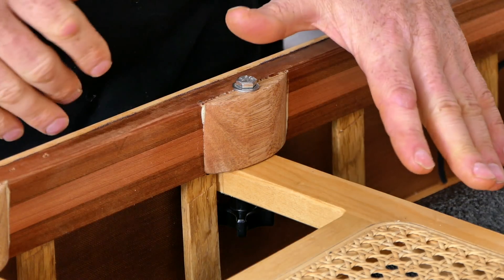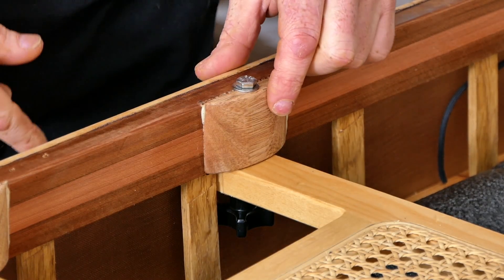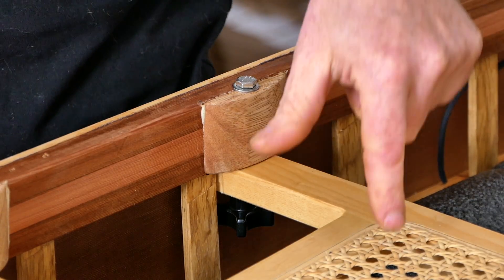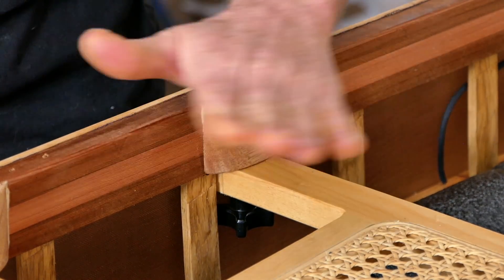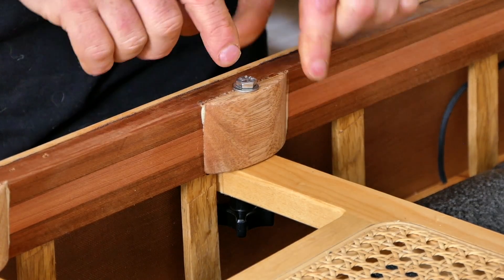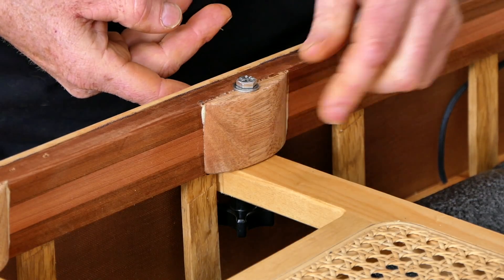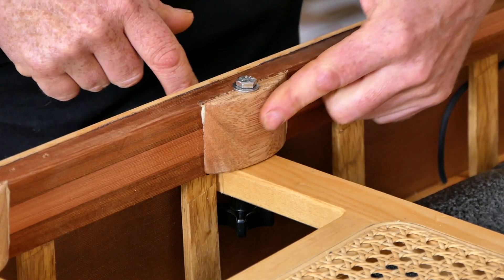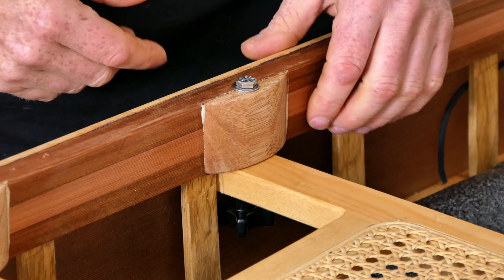Just a couple of quick technical notes for any students watching. If you decide to set up your shallower canoe this way, I would never put a cane seat in any canoe — unless the material is synthetic and made by hand, these never last. You always want to go with a web seat. And if you're thinking about nesting shallower canoes like this, keep in mind that the same nesting geometry applies: they need to be two inches difference in width to accommodate for the seat blocks, as opposed to the inch and a half difference we use normally for shallower pack canoes.